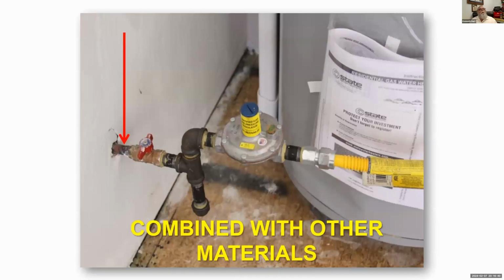If you look against the wall here, there's a small piece of copper. It's a 1/2 inch sticking out of the wall. Somebody's brazed a male adapter onto the end of it, and then screwed on the gas cock, and then of course you can see the black iron. You've got your sediment trap there, but there's the regulator, and that regulator is what makes this 2 pound system work. He's got 2 pounds of pressure up to the regulator.